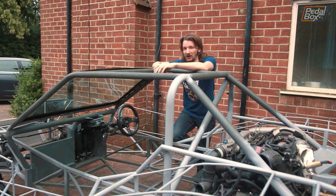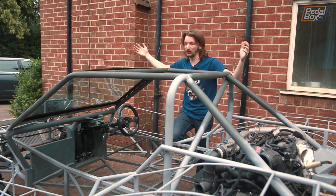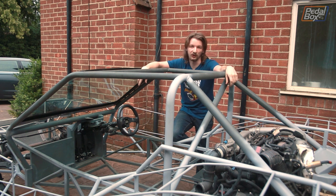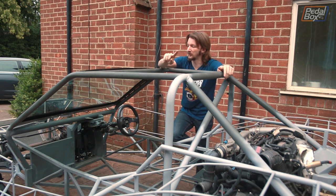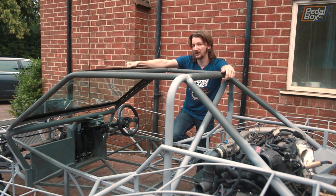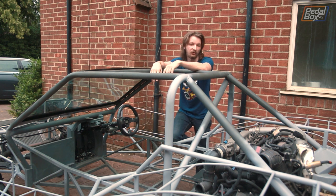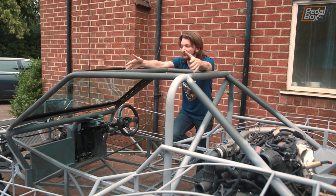The amount of car he's added is pretty impressive, so I'll go through piece by piece, starting with the cage. The cage is probably the biggest, coolest part of all this work — it's a proper full six-point cage. We've got A-pillars running all the way down into the bottom corners with a windscreen surround now supporting an actual glass windscreen — albeit broken. There's a proper rear roll tube covering the seats and where our heads and helmets go, rear stays supporting the rear suspension to keep the car rigid, and nice big diagonal cross-bracing in the back to stop twisting. Colin at Ignition Motorsports bent the tubes; the installation and fitment was all Adrian.